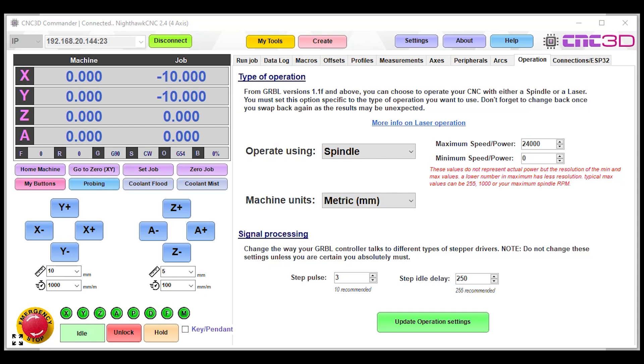The reason we created this video is that HY VFDs are known to be extremely troublesome. They're very inconsistent between models, so the exact same model number may require different wiring configurations or different settings changes in order to accept a standard zero-to-ten volt input — which is what pretty much every VFD on the planet has used for many years, and is the output that our Nighthawk provides for speed control.